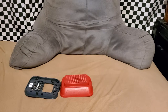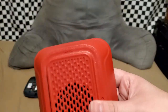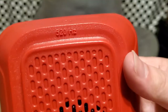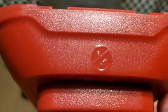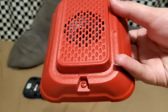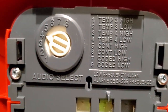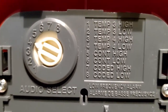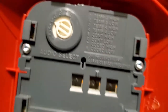Let's go ahead and start off with the first device here. Obviously it looks like it's just an audible device — there's no strobe on it. There's a label up there that says 520 Hertz, so this must be a low frequency sounder of some type. There's an icon telling you not to paint over this device, and down here is a mounting screw. Up here you have a code wheel with eight different options: high and low variance of outputs of Temporal 3, Temporal 4, continuous, and coded. I'll explain what those mean in a minute.